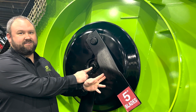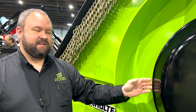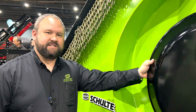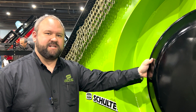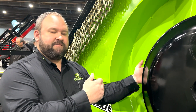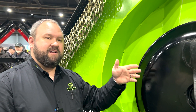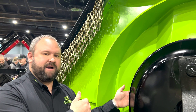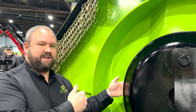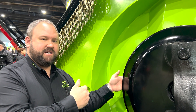Three-inch down shaft on the Bondioli rated at 260 horsepower. Another feature on the Series 5 XH1500 compared to the Series 3 or Series 4 previous models is two inches of increased cutting depth — from the gearbox mounting face to the pan is two inches longer. That depth has increased the cutting capacity on the chamber, as well as increased the cutting speed. We found a 25% increase in cutting speeds throughout all the testing we've done so far.